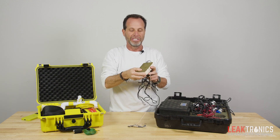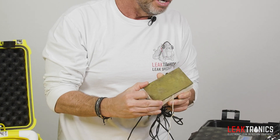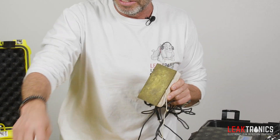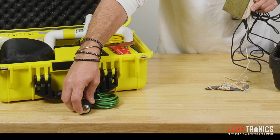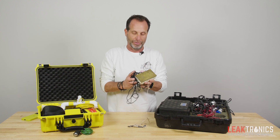Because the Leaktrack float is completely copper, it does give a good signal — copper is a good conductor — but you also have to clean it all the time. We're running stainless steel out of our actual transducer, and every once in a while you wipe it down with a rag, but you don't have to do any sanding whatsoever.